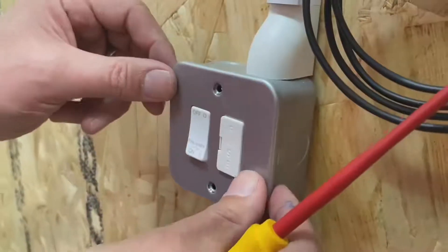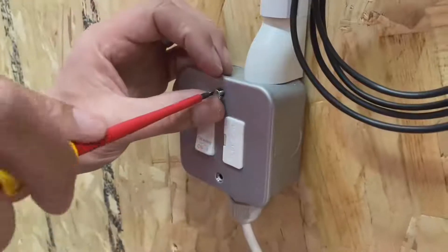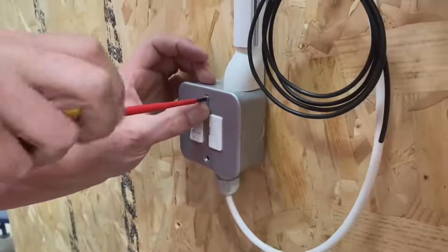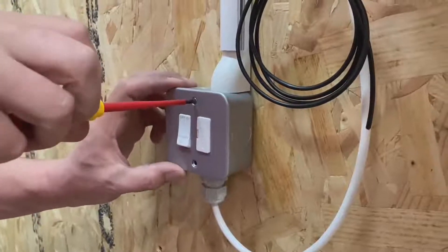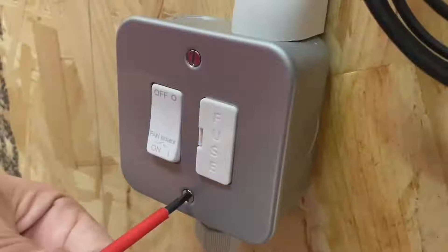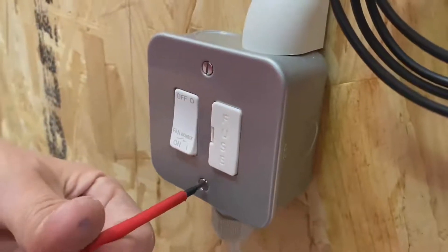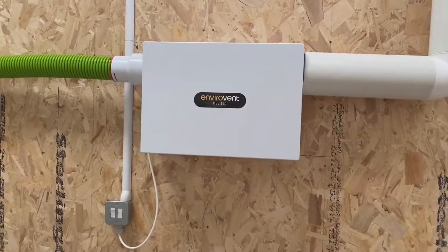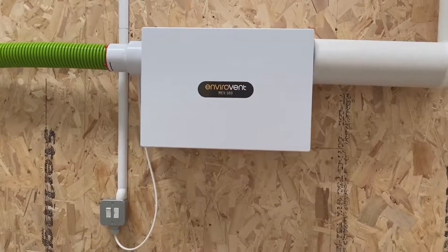The front plate goes on - are these screws going horizontal or vertical? I've used this with mini trunking and a handy adapter that adapts the mini trunking to the knockout in the top of the metal clad box. I almost didn't notice it, so it shows you how good that is. It's going vertical, and as we step back, that's a whole house ventilation system, probably housed in a cupboard, with local isolation.